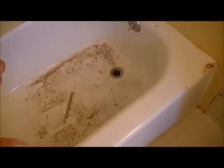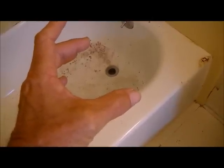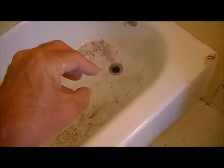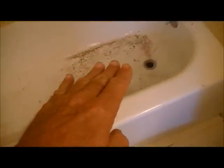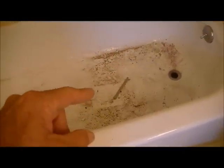Unfortunately this is a slab floor, so the drain is going to end up staying basically where it's at. When I take tubs out on new construction, there's a square opening and you're looking at dirt. Sometimes I'm actually able to get the drain out from the wall another 4 or 5 inches. But sometimes the square isn't big enough and the drain has to remain where it's at. On wood floors I can always move the drain to center, but concrete floors require a lot more breaking up of the concrete.